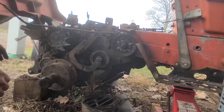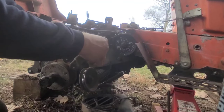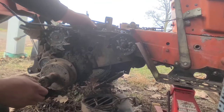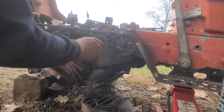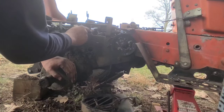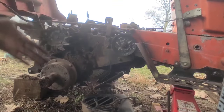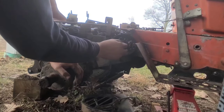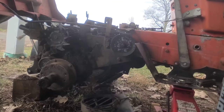That's 5/8. I just noticed this bolt and bushing aren't working correctly - I'm going to have to take that bushing out and clean it, it's stuck. That comes out of the way, you can unhook your brake rod from that as well. It's half inch. We're going to have to take this pulley off and then take the bolts out for the plate, and the plate should come right off. I'm hoping I can just drill two holes in this, put a puller on it and it'll come off - that's not always the case.